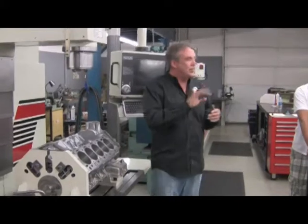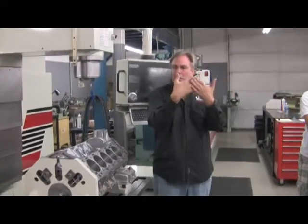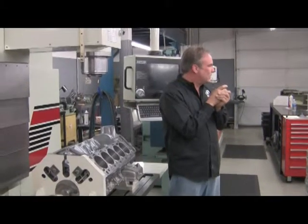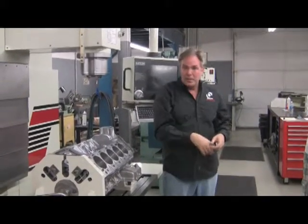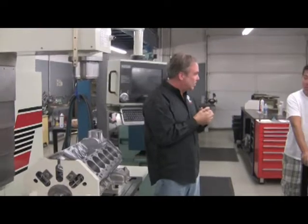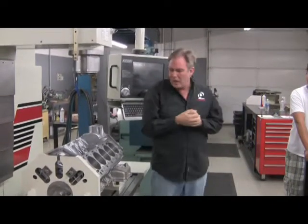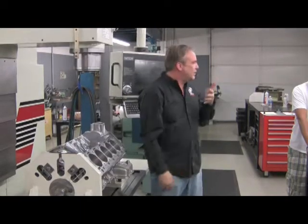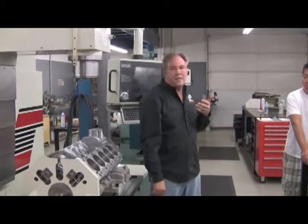Normally you have a crosshatch, a hone in a cylinder, and in the grooves of the crosshatch, oil is stored, like little reservoirs. Every time the piston comes up, it drags oil up with it, and that's what stops the piston from sticking to the cylinder wall, those little reservoirs. On this thing, you etch the aluminum away, and in between the silicon crystals, the oil resides like it would in the crosshatch. And that's your lubrication. So you're actually riding on oil and silicon.